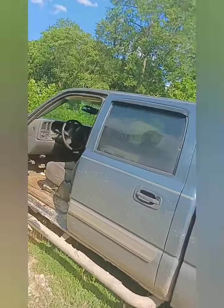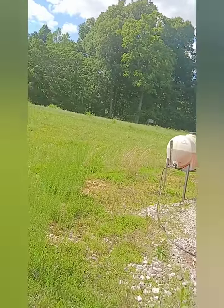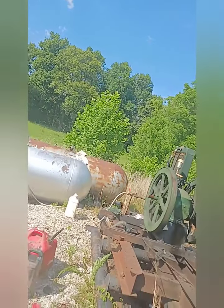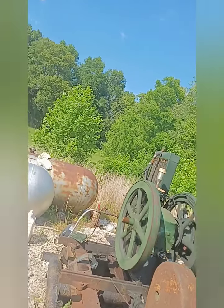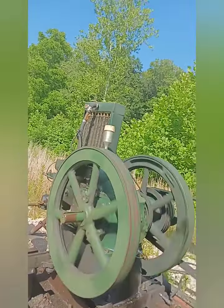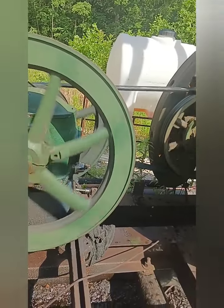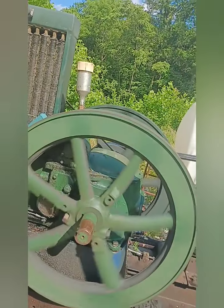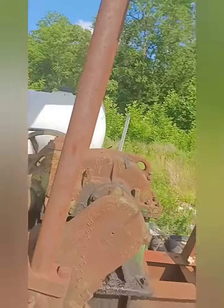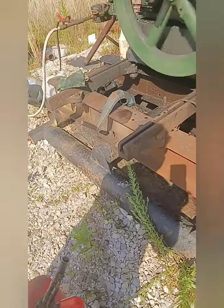I think I need to get a little more cardio. That shouldn't have winded me like that. But to be fair, this motor here is pretty tight to crank. The tension I have on the belts don't let the clutch completely disengage. So I'm also pulling against the tension and friction of the clutch in the unit. It has brand new oil, and that's already turned solid black due to heat and being whipped. Modern oils are not designed for the application that we're using it for, but we don't have a choice in the matter. That's all there is.